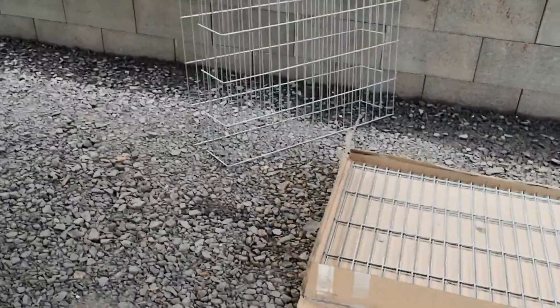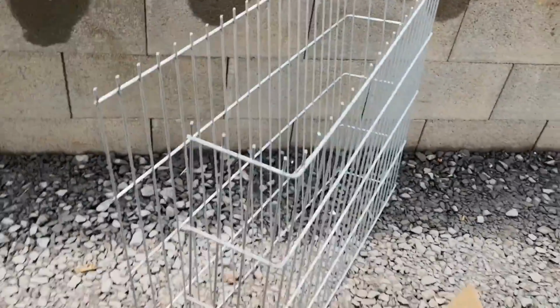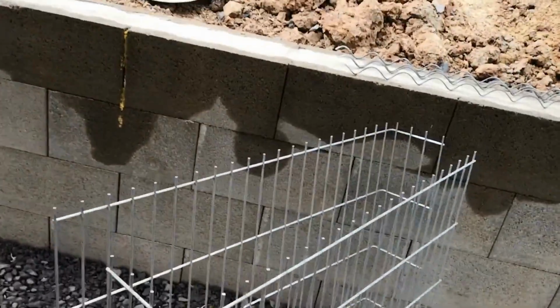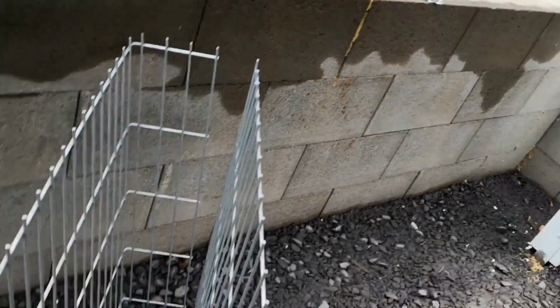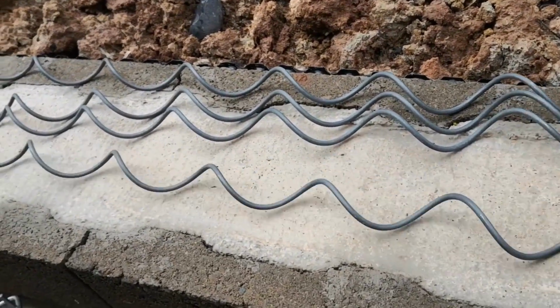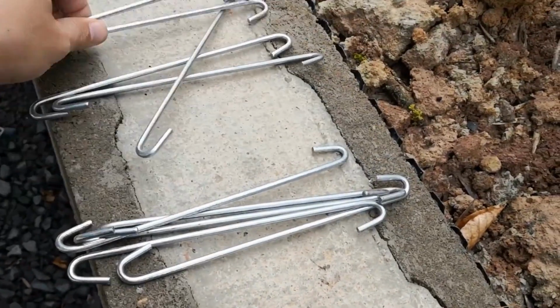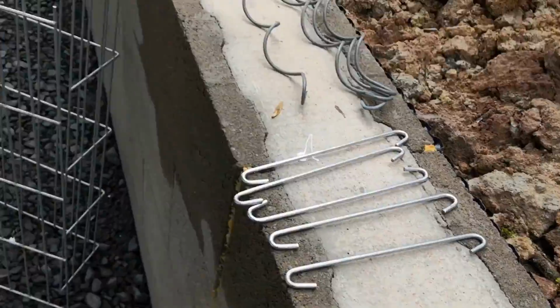Two pieces of material and fabric. In this particular case, a height of approximately 80 centimeters with a width of about 1 meter. What is special about these gabions is that they are designed to be used both at the top and at the bottom. The open parts are each made as L-shaped components. The connection is then made as with many gabions: spiral rods are included, and in the accessories there are spacers, which position the gabions at a distance so the filling does not overfill them.